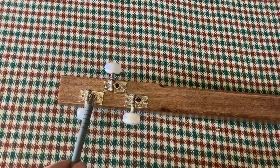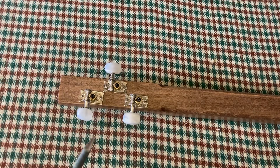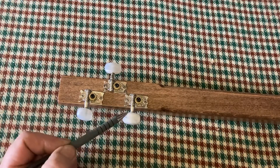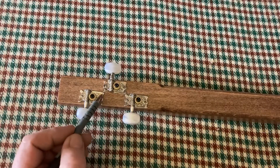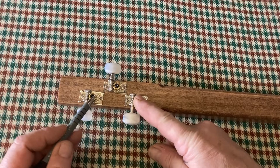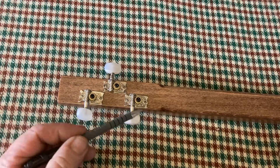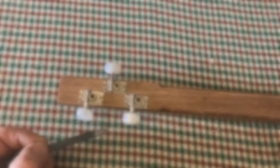As you can see, these are pretty tight together. You've got to watch this type of machine head, which has got basically a square footprint. So if you get them as close together as this, you've got this little overlap. Sometimes you may find you've not got enough spacing between the machine heads to get them to fit properly. So word to the wise — just check, lay them out on your bench to make sure you've got enough clearance.